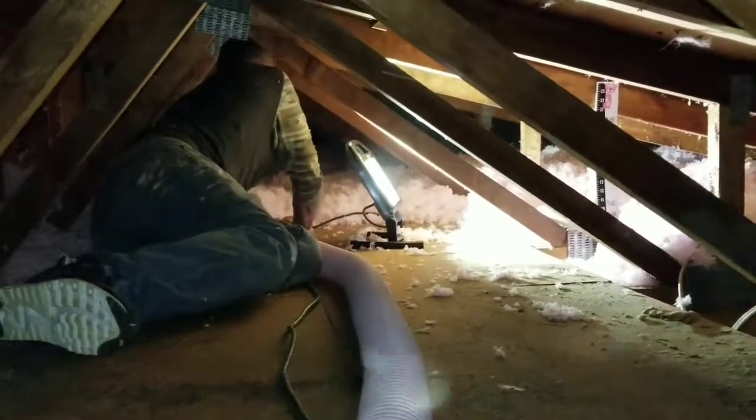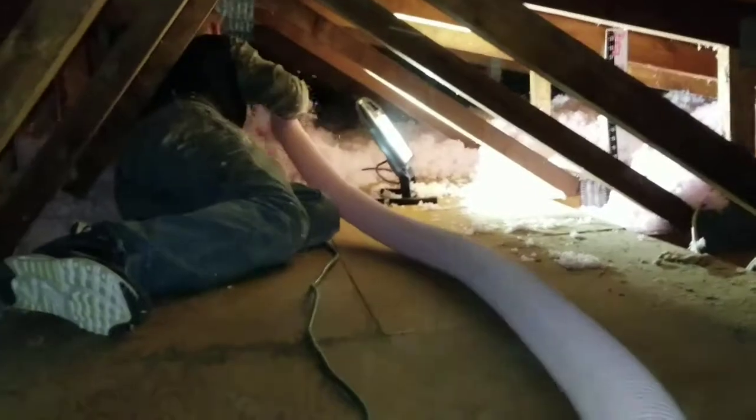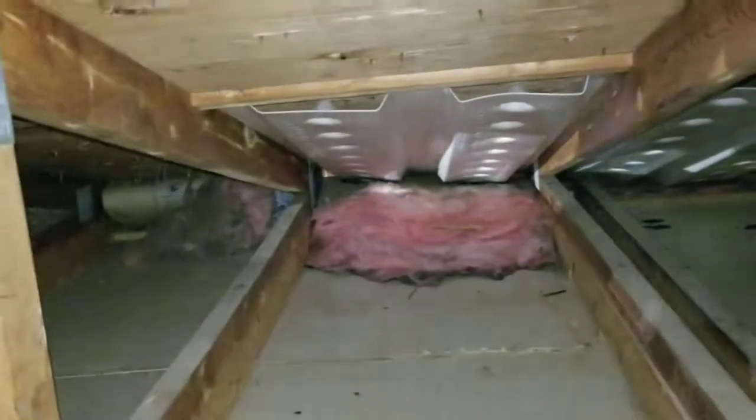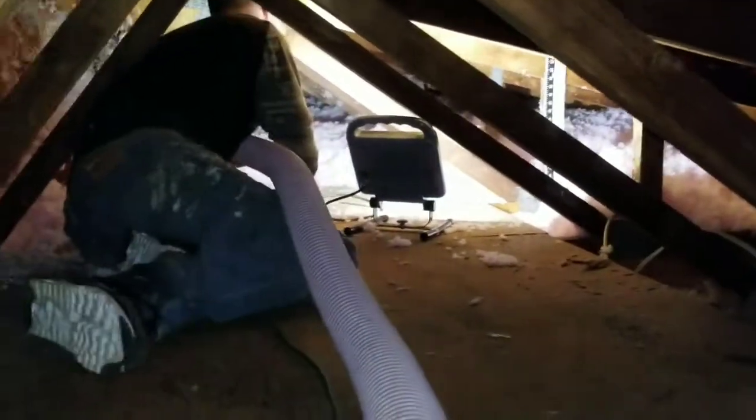And if need be, when we come out, we'll actually measure, use some tools to figure out just how many square foot you have. But a lot of guys will do this installation and they won't put in these baffles, which is actually doing yourself an injustice. Those are the most important thing about this attic, them baffles. They gotta let the air flow from the outside. You don't want mold in your attic, trust us. I've seen it many times. Make sure you hire a reputable company too to do your job. This video may help teach you what they should be doing and shouldn't be doing.